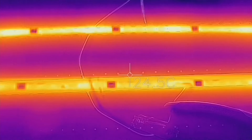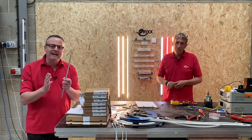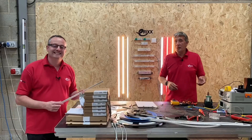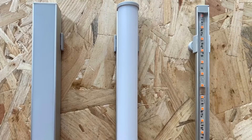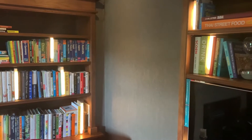If you don't manage that heat properly, it can affect both the short-term and long-term reliability of the installation. We'll see how a profile — or as I call them, extrusions — can help you manage the heat generated by your LED strip, and how they can also form part of the design process, helping with diffusing light, reducing glare, and allowing you to build them into building structures, furniture, and other features.